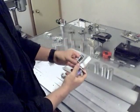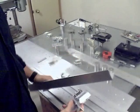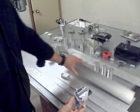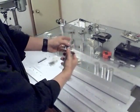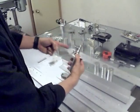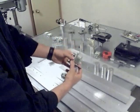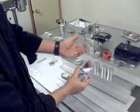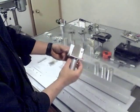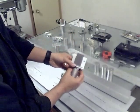The mirror mount, which is the most complicated, has an L-piece which comes from an L-beam cut to size, with the screws put in so the L-beam goes like that. The metal plate goes in front, we put the holes through in the appropriate places, then just screw through with the springs. The mirror is just glued onto the outer piece. It's fairly straightforward — just taking simpler components and putting them all together on a plan.